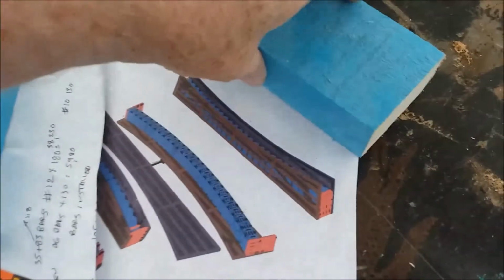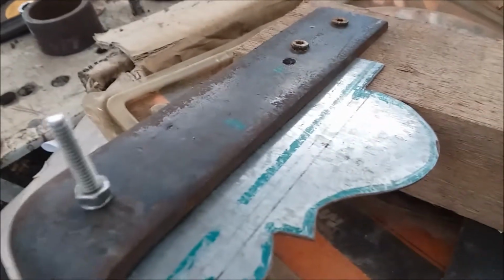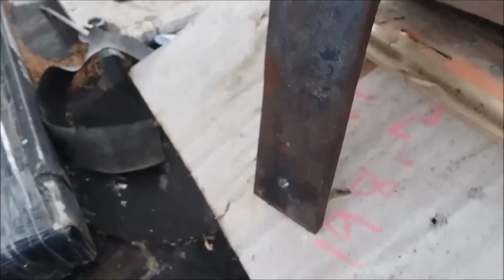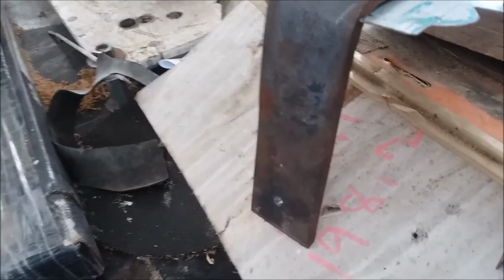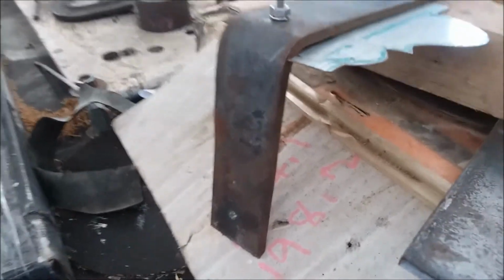And the purpose of the thing in the end is, this is a mirror image of what we want the edge of our counters to look like. We want a round end up at the top when you lean on the counter. And we want some places here that are drip edges. If something's running down off of it, it won't run down up under the counter and into the cabinets underneath. So there's some pointy things that make it drip off. But that's just us.